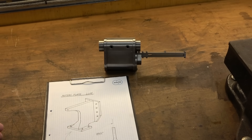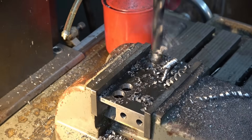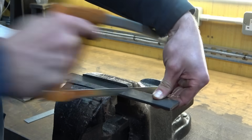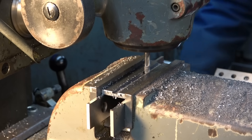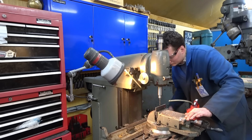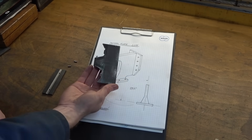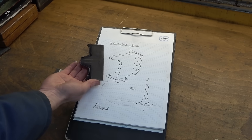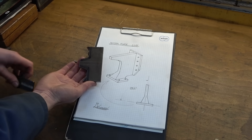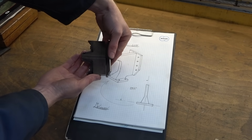First of all I'm going to take my rough pieces of material and do some roughing-out operations on them. I'm making this assembly as a back-to-back pair — one piece here and then the mirror image above it — and this just cuts down the number of soldering and machining operations required later on. The backing strip has been made at twice the length and that's ready to go on.